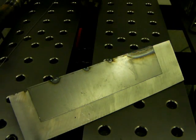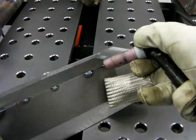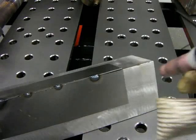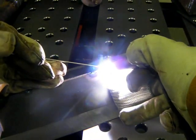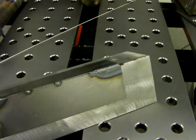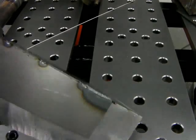This is strictly an option if you've already got a stick welder — a way of getting your feet wet with TIG welding without spending a fortune. You can get an air-cooled TIG torch off eBay pretty cheap, plus a flow meter and an argon bottle. You're going to need an argon bottle eventually whether or not you upgrade anyway, so that's kind of a wash. For a few hundred dollars, you can convert your stick welder to a TIG welder. It doesn't take very long to figure out the amperage settings — I've got it set on about 60 amps on the buzz box, giving me about 50 amps DC output, and it's close enough to make adjustments with travel speed.